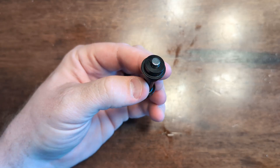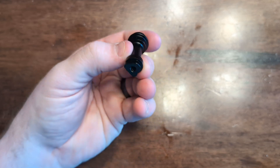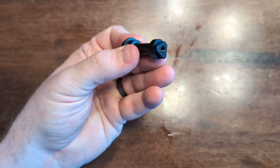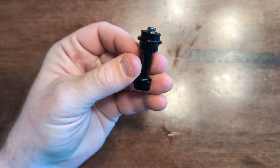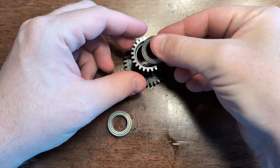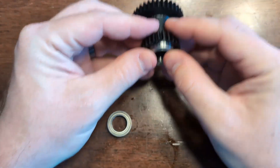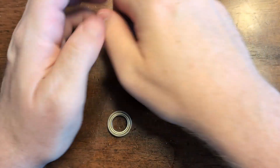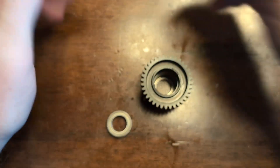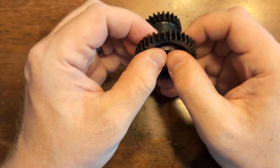Now's a great time to press your magnet into your center column shaft. This will be found in your absolute encoder kit, and you'll want to use green Loctite to make sure that magnet doesn't spin on you later. Now we'll take our two 6802 bearings and press those into the top and the bottom of our double gear. You should be able to do this by hand, either with two fingers pressing in or just pushing up against the table.